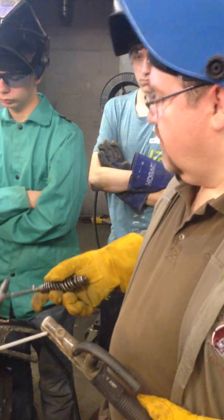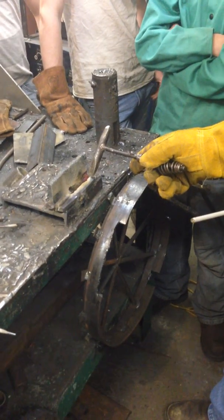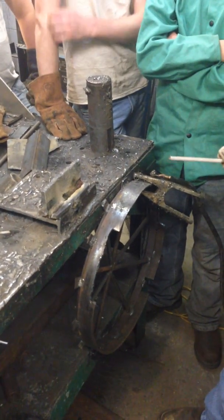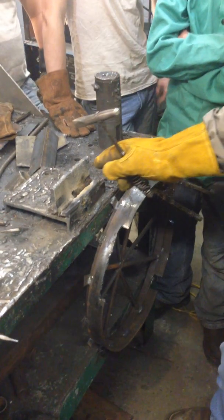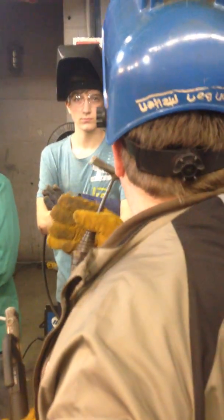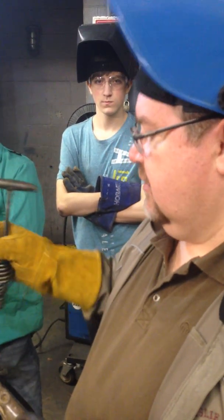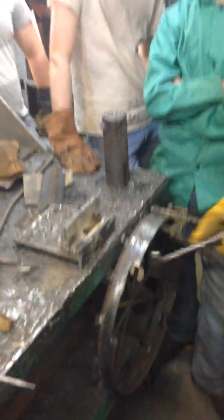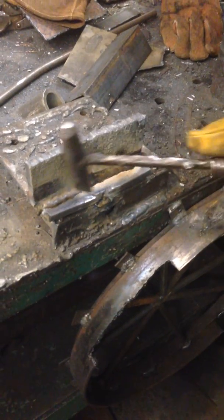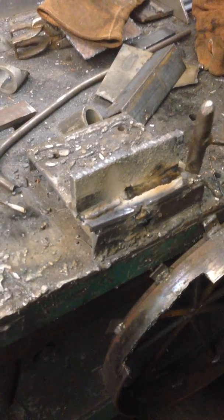Here's another little tip I want you to remember. When you get to the end of the weld, a lot of times the leftover part there at the end is going to be a little crater — it could leave a small opening or gap there. So when you get to the very end of the plate, hesitate there for a minute to let it build up. Because you've been cutting out as you come up to it, hesitate there. Sometimes you might even go back a little bit just to make sure that the end is welded all the way up. I don't like to see the weld run out at the end and not cover the plate, and I don't like to see that in the beginning either. I like to see you start at the very edge and run it all the way through until you run off the plate.